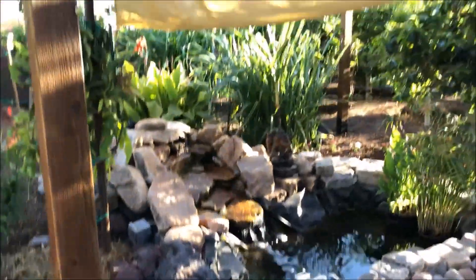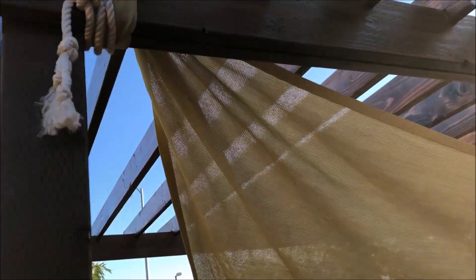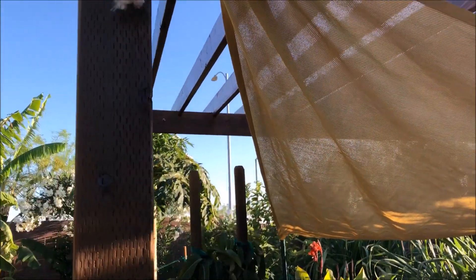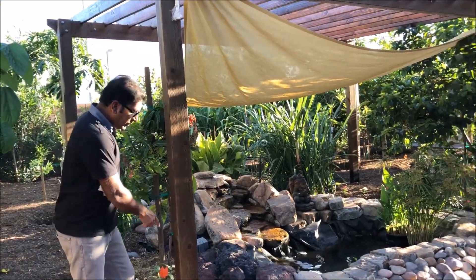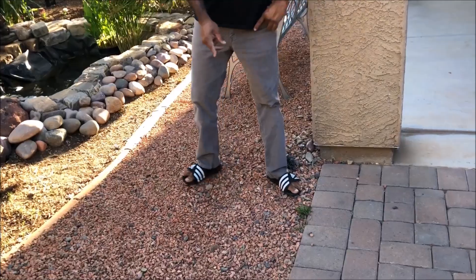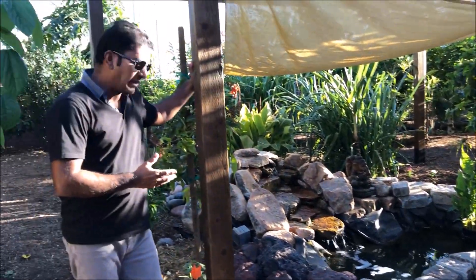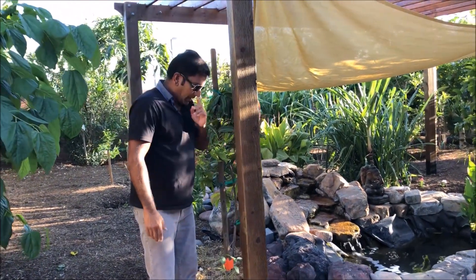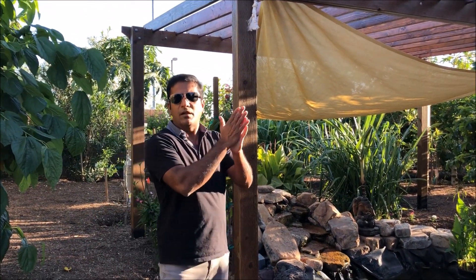There are two 16-foot headers. I connected the headers to the poles with half-inch bolt and nut — it's pretty strong. The challenge was that the ground is not completely flat due to my koi pond nearby. I measured using an X, Y, Z axis setup: the X-axis from the pole, the Y-axis along the sidewalls, and the Z-axis for the vertical. I used a pole leveler — about five dollars at any hardware store — and all holes were pre-drilled on the ground before installation to make the job easier.